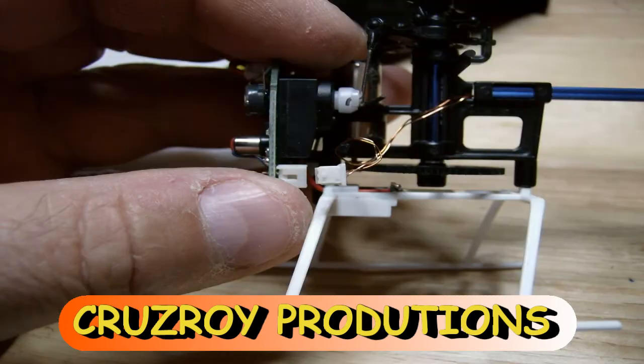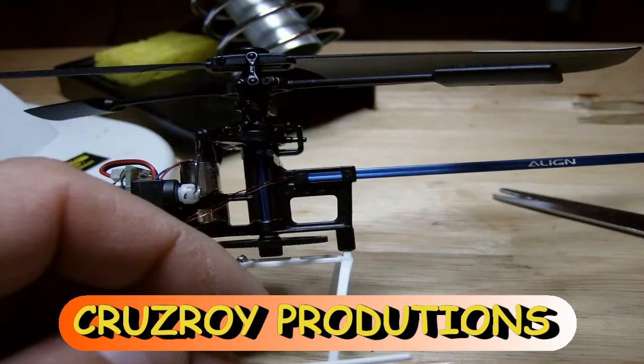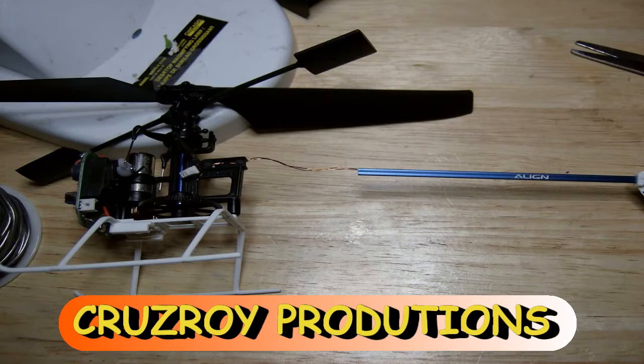It's very hard to get out — watch those little gold wires, because all they are is epoxy-coated armature wires. Once you do get that released, gently try to pull and tug to get the boom out of the main Trex body. Pull really gently, because you could break these little wires or score them on the aluminum and get a bad ground. Once you've got it out, pull it out as far as you can until the connector hits the base. You don't want to remove the connector — it's a little difficult to get on and off.